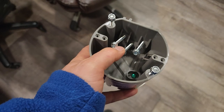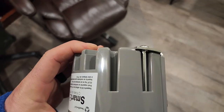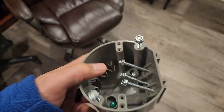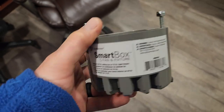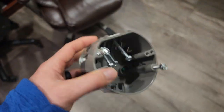But what this is, is it's set up with three pre-mounted screws, and you'll come right in. So you'll take that round ceiling box out, you will slide this up in, you'll screw in your three pre-mounted screws, and then you're all set up with a ceiling fan rated box. I think it said it holds up to 75 pounds. It's something I just wanted you guys to see. I hope you have a great day. Let's get to it.